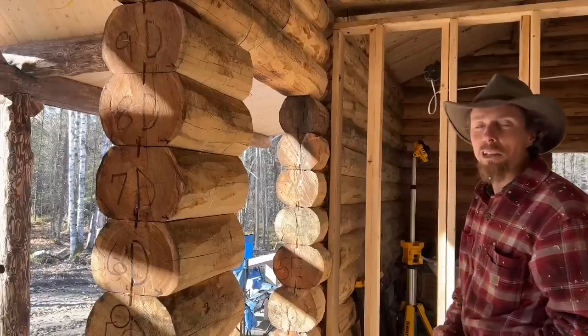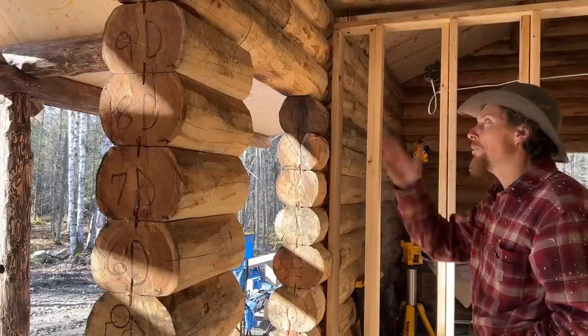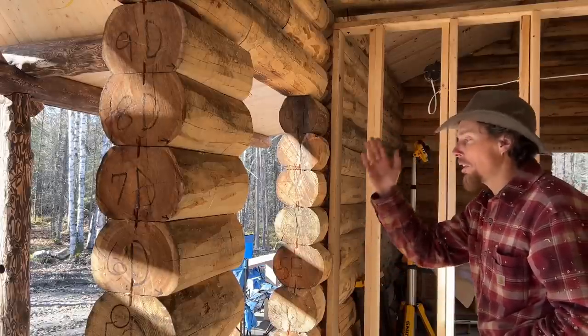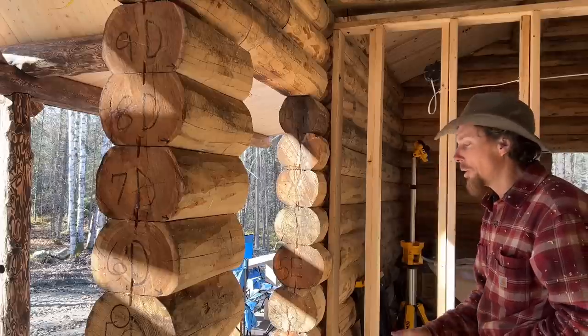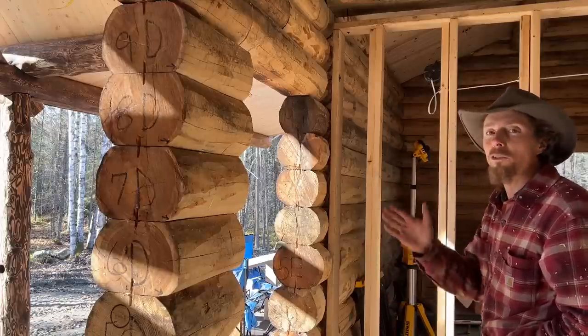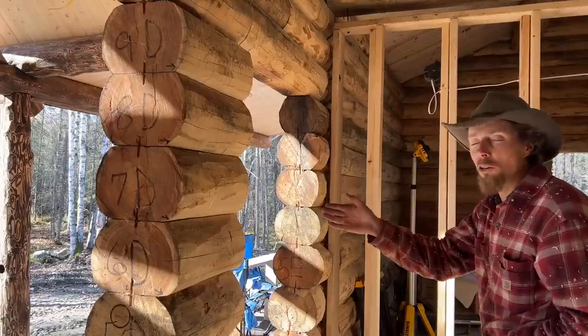Everybody likes to do things a little bit differently. I like to make three cuts, and for me, I can get it more accurate. I do my first cut and really concentrate on getting it straight. Then my second cut, I go about two-thirds of the way through. The final cut, I go all the way through. If you have a saw cut there, your chain naturally wants to follow the same groove. If you just go all the way through the first time, a lot of times it wants to go back and forth a little bit.